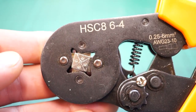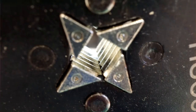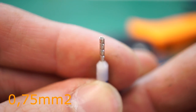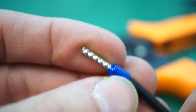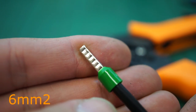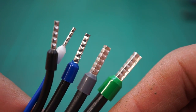Now let's finally check our Chinese crimping tool. The build quality is not so good — on first view you can see this is a cheap tool, but the essential parts seem to be okay. Here you can see the details of the teeth inside the jaws. The final shape of the crimped pin is square with signs of teeth, which is perfect for some types of terminals. The biggest advantage of this tool is that it is self-adjusting, so you use only one size of jaws for all cable sizes from 0.25 to 6mm². However, this tool uses a spring for self-adjustment of power, meaning larger pins are crimped harder than smaller ones. You can see how much detail of the teeth appears on a 0.75mm² versus a 6mm² crimped pin.